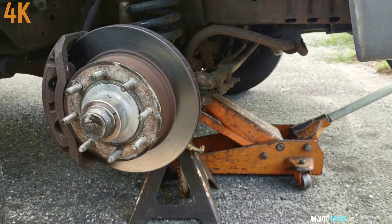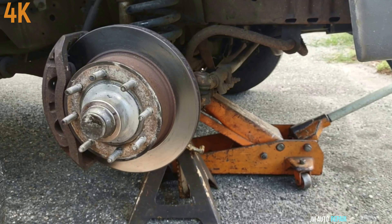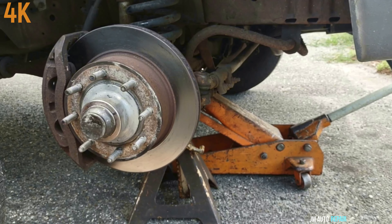You can feel it when it hits the bottom. And the first thing you do is push grease into the inner parts here on both sides — push the grease all around here with your fingers. All right, believe it or not I've been greasing this for about 10 minutes because it's not easy. It's a very slow process to get the grease in. You have to get a little bit and then try to get it in, and some spots here I can see that the grease is starting to come out from the other side.